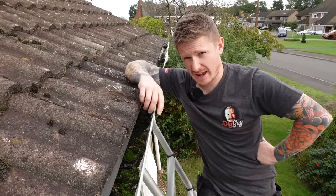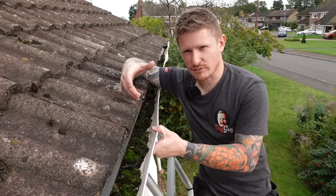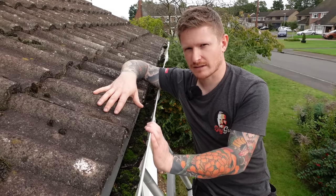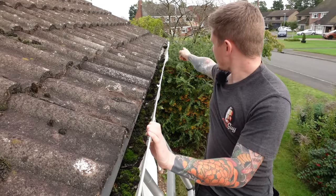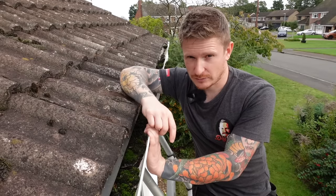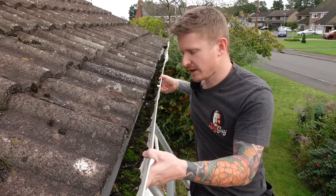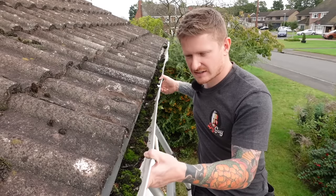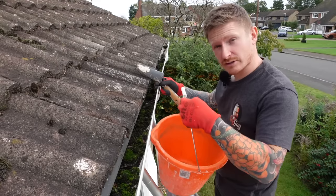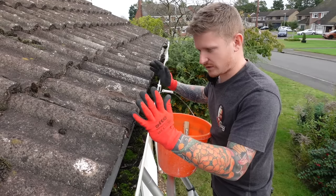Before you switch off your outside tap for the winter, you need to clear out your gutters. As you can see, there's quite a lot of moss, soil, and debris that builds up over the year in your gutter. Every year before winter I go around and clear out all the gutters to make sure rainwater flows down the downpipe nice and freely. If you don't do that, it can cause damage and damp in your walls. These ones are absolutely full of debris — I only bought this house in the spring so I haven't done these yet. I just use a bucket and a small gardening trowel. You can hook the bucket over your ladder or use your fascia brackets to hang it, so you have both hands free.